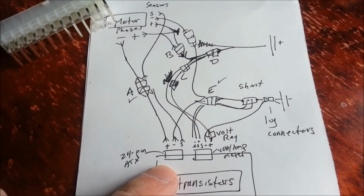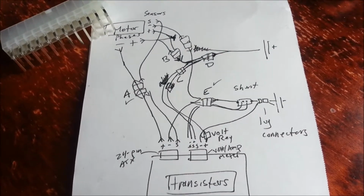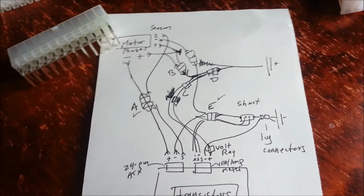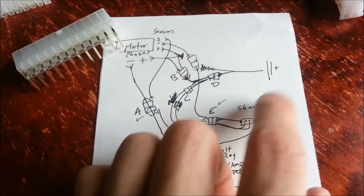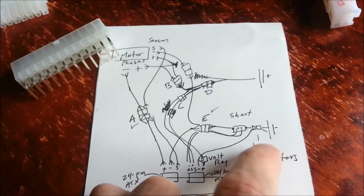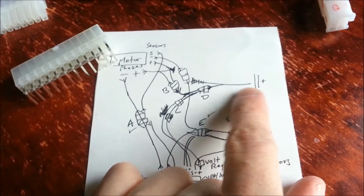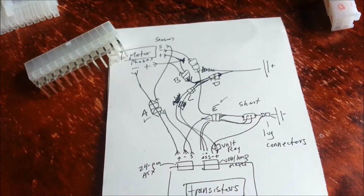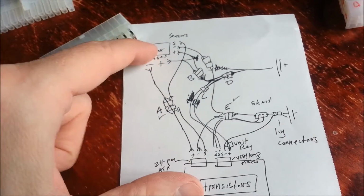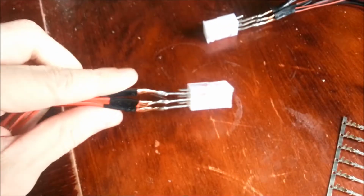Now of course, you're probably aware, but the convention for electricity is kind of backwards. Not kind of, it is backwards. Back in the 1800s, when they were diagramming everything, they thought charges flowed from positive to negative, but that's before they knew about the electron. So the electron's what moves, so in reality it goes from negative to positive. But in wiring diagrams, they always say it goes the other way, just because that's what the convention is. So really the electricity is going this way into the motor, but it doesn't really matter for the purposes of this. But anyway, this is going to be that connector.